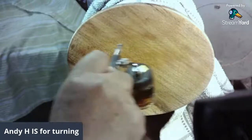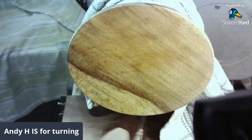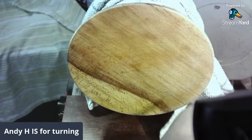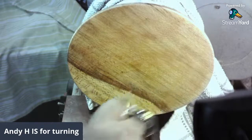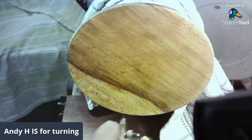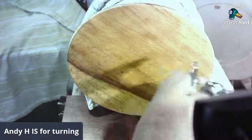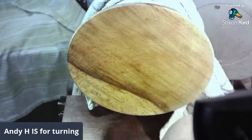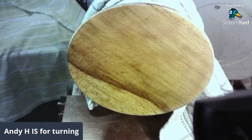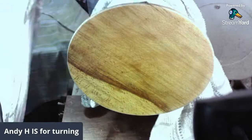But you start with your lightest colours on these sort of things. Yellow is not a great colour on ash usually, but it will just give it a hint of colour. It's one of those colours that you can put over a white wood just to lift the white wood. I occasionally use it on pens if I'm doing pens with heartwood and sapwood in it. It just lifts the sapwood to a different degree without killing the colour of anything.